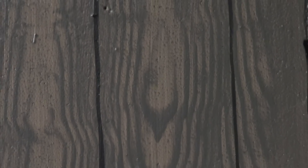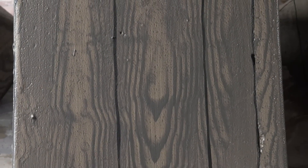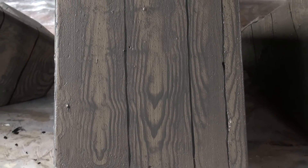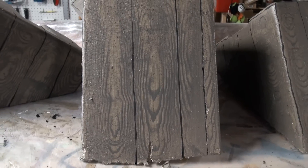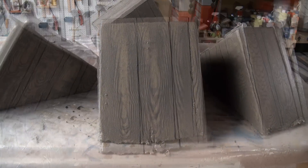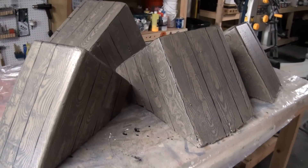And you're done — it's quite easy. I didn't clarify earlier, but make sure you let this dry in between each of these steps. You paint your base color, then put on a darker glaze and make striations. Let that dry, then put on a darker glaze and use the wood graining tool, and let that dry. It's simple as pie, and pretty soon you'll be doing wood graining to anything that's not moving.